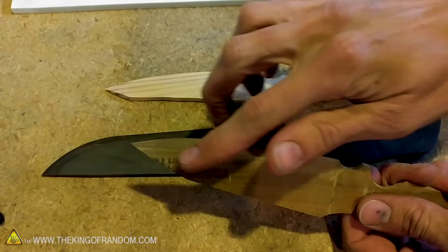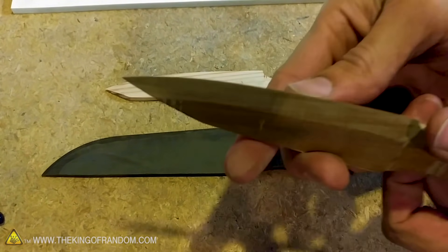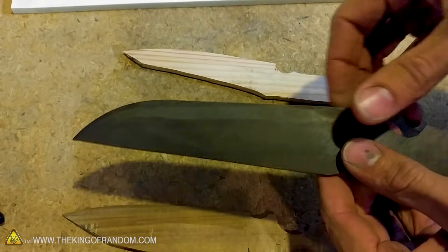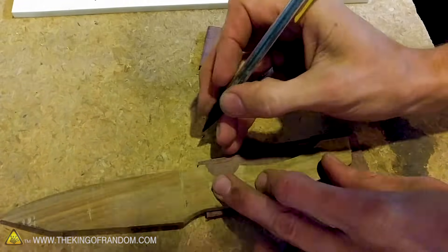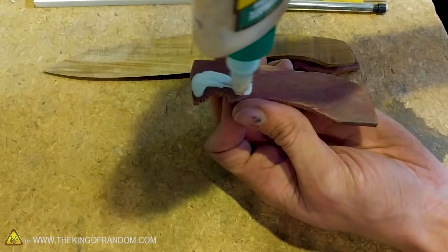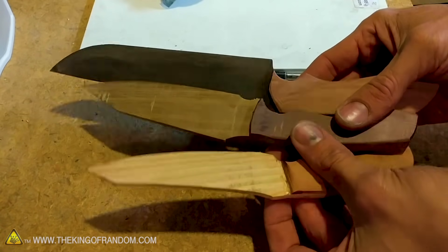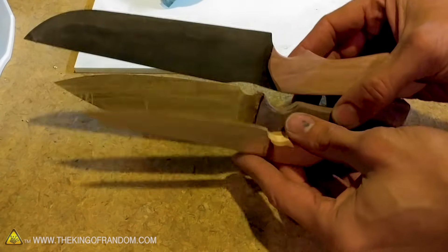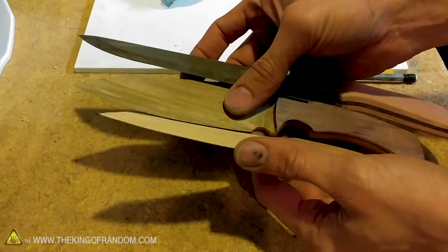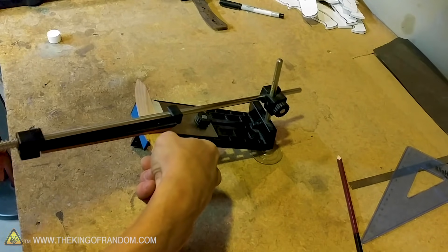Our knives have the basic beveled edge to them now. They aren't sharpened by any means — there's an edge, but I don't think it's much of a cutting edge at this point. I do want to actually try sharpening them with a sharpening system, but I have just added a bevel on. Just for fun, I'm going to go ahead and add some handles to these. Now you can see I've got handles attached to all the knives — I do think it makes them look nice. So now what we need to do is take our knife edges to just as fine and honed of an edge as we can possibly get. I do have a nice little knife sharpening system, and that's what I'm going to use to give them that final edge.